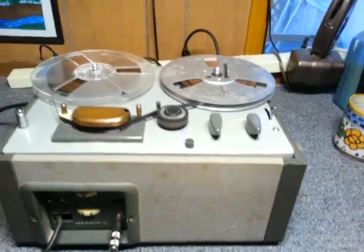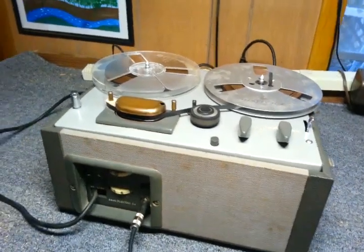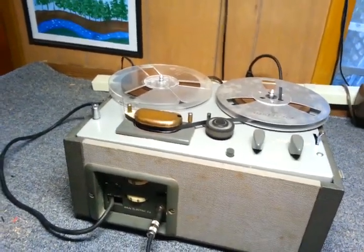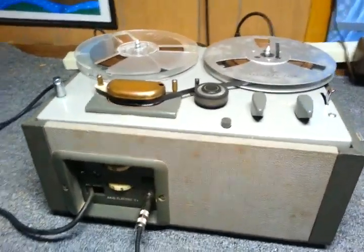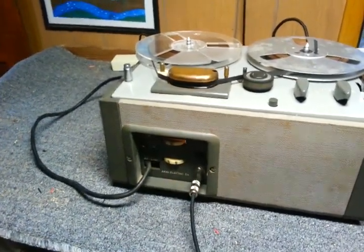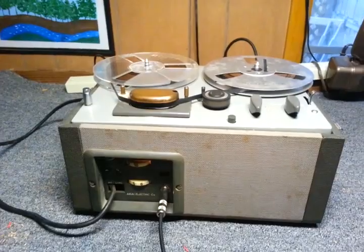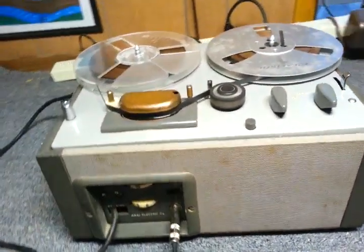And so then I decided, after having the hum problem, I wondered if it was ground loops. So I put the grounds of the capacitors I replaced in the spots where they originally were grounded, and the hum problem was fully fixed. So it was not some strange thing about filtration. It was obvious. It was the ground loops that was a problem.